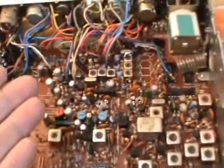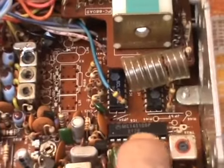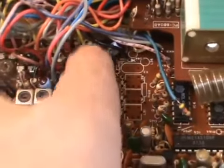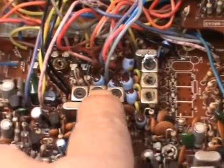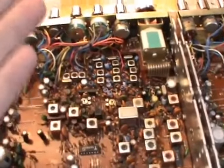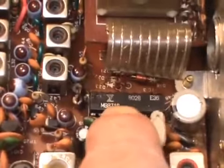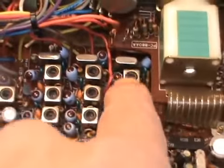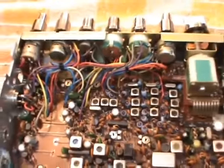This is the Mark 2. You'll notice it's got the phase lock loop here and the two binary adders, and the one loop offset. It's the crystal layer and then it's offsets, then it's carrier oscillator offsets. And then here we have the Mark 1, known as the Mark 1 Cobra. This only has the one IC down here - MB8719 - and three sets of offsets and its carrier oscillator.